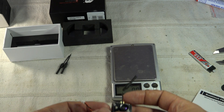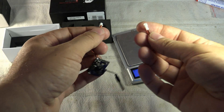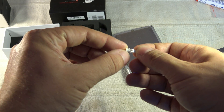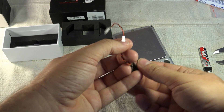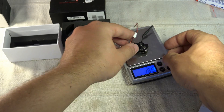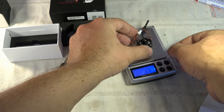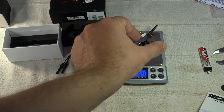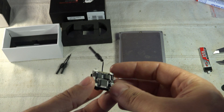If you have a classic tiny whoop, you should use the micro JST extender cable, and in that case you'll end up with a male connector. The combo will add some extra grams, but not too much — you'll be around 5.9 grams total. We also have a 25 milliwatt video transmitter.